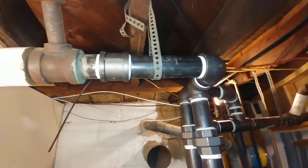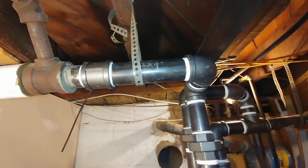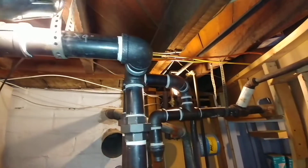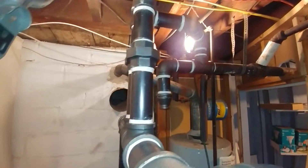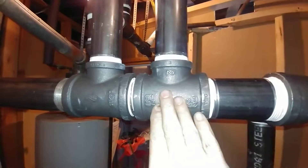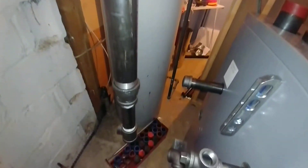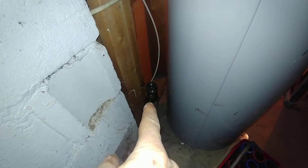There's the tie-in to the ordinary parallel flow main, with swing joints making that work. Here's the other take-off, and this is the sort of experimental rough-in that we have. We're going to have the wet return coming in there.